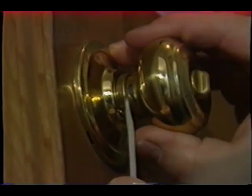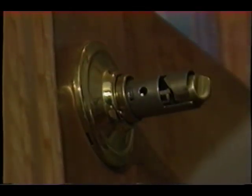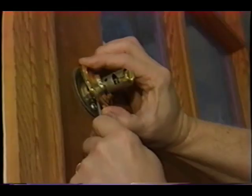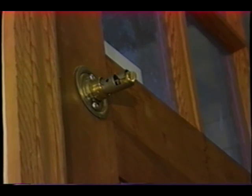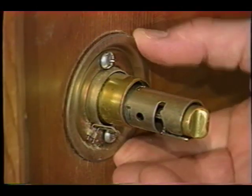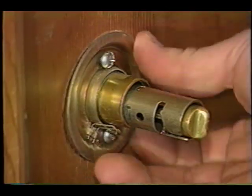The first thing you have to do is look on the inside of the door and you will find, generally speaking, a very small little slit — a little spring-actuated piece of metal that you can push in with the small screwdriver, and it allows you to take the handle off the door. Once you take the handle off, you can then take the brass or chrome escutcheon plate off the door, which gives you access to the two screws that will tighten the doorknob back up.